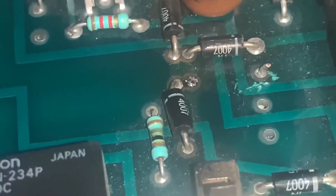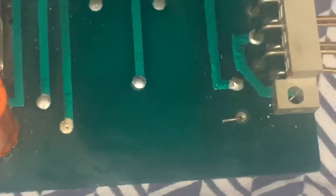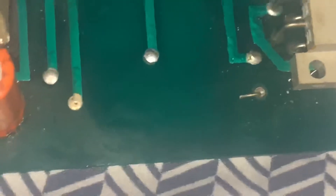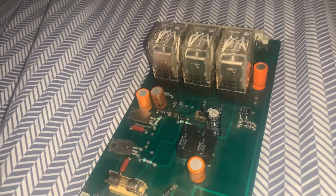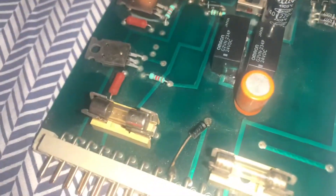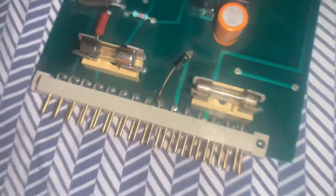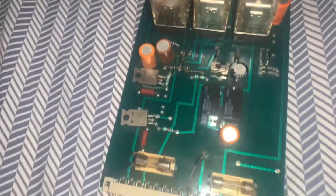I'm going to buy a new diode or replace it and see if it runs after that. I also need a new claw strength potentiometer, which basically controls the claw strength. Everything else on this controller board looks really good — the relays are in great condition, all the resistors and fuses look good, I've tested the fuses and they both work. Overall a very nice looking PCB for its age; keep in mind this was made in 1984. Alright, 30 plays, here we go.